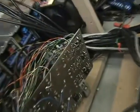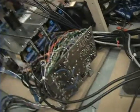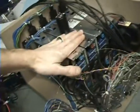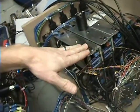I had a problem. I designed it so I could turn this all the way up and it wouldn't max out, because when it did, it reversed polarity on these steer amps and it was very bad. So I calculated what resistors I need, and each one of these is different. So imagine that. What I had to do is put variable resistors on the back here where the resistor is that I wanted for the highest point. And then on these, you can adjust the voltage just barely, and so I adjusted the voltage on them just to get them just right.